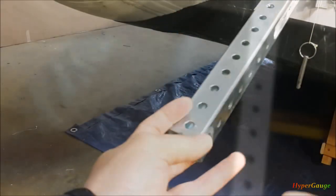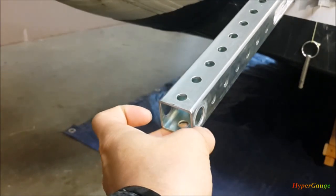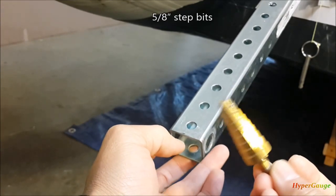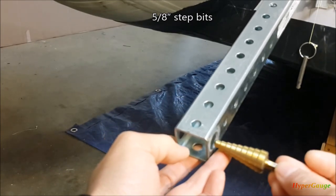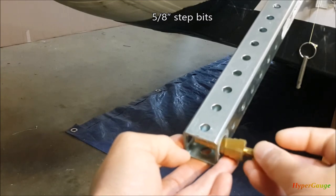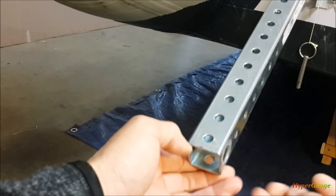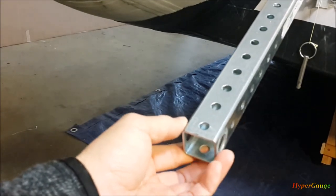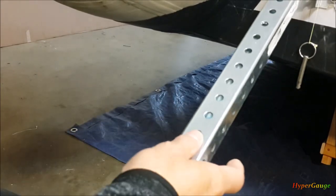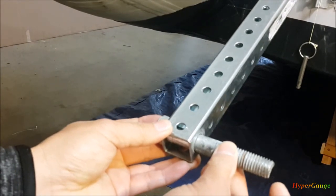You can see how it mounts and also how to enlarge the holes for the axle — right here. I'm using one of these step bits to enlarge it with a drill. I put a couple drops of oil when doing it and just drill for both sides. When it gets closer, you want to do a test fit to make sure you don't over-enlarge the hole. The idea is it will fit just right without taking off too much material — you want to keep as much material on the tube as possible to retain the strength.